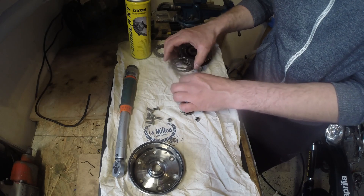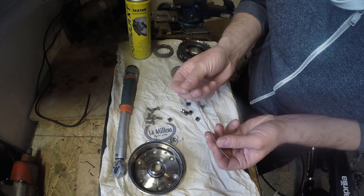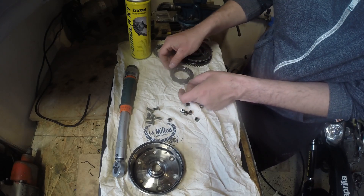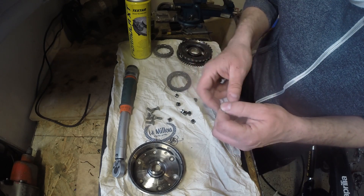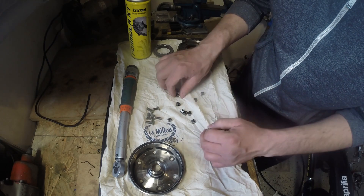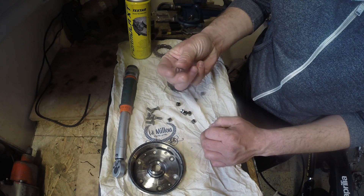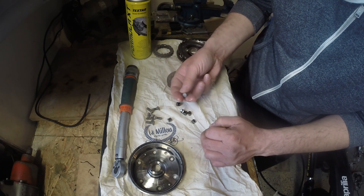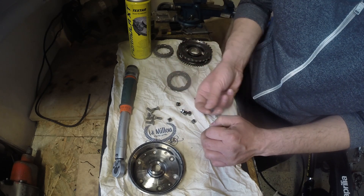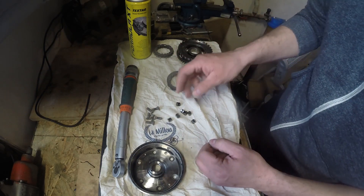So what would actually happen? It's easy. This spring which is all around this bearing just snapped. What that caused is that those pieces were not aligned as they should be. Some of them were tightening, some of them were not tightening or were loose. That's why the bearing just works randomly.